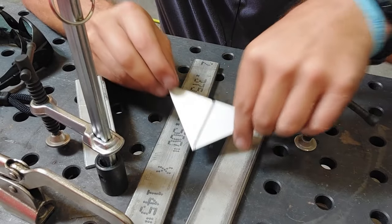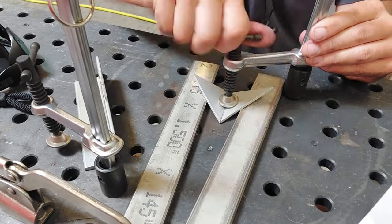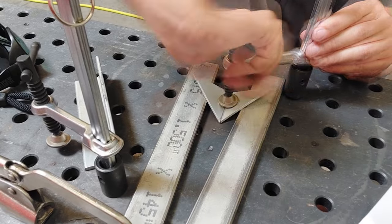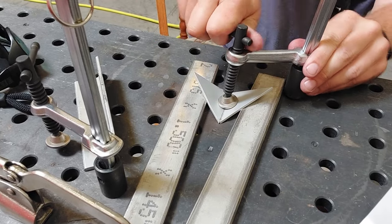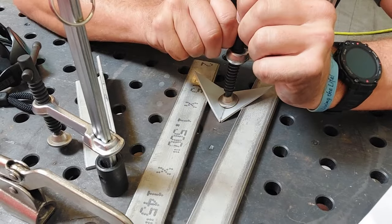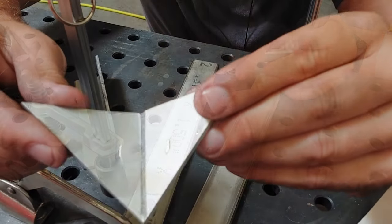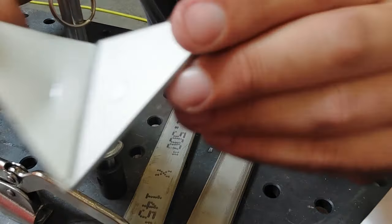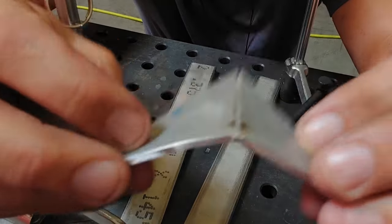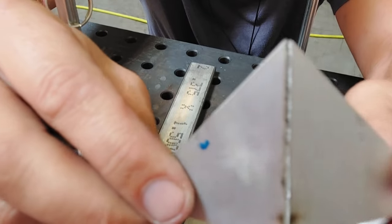Here's the second piece welded on one side. I'm putting tons and tons of pressure on this thing. That's as far as it's going to go, and it's still in one piece. You can see I dented it up with a lot of pressure — no cracks whatsoever in the weld. I would have to say that's pretty well penetrated through for a single-side weld.